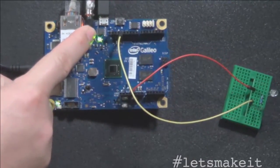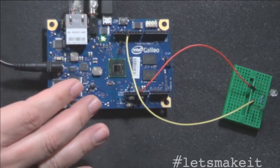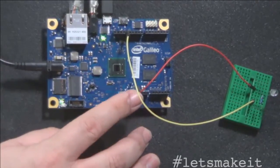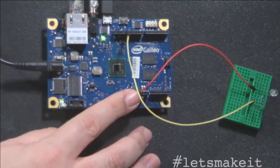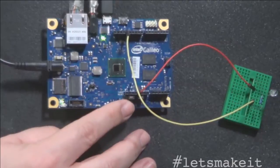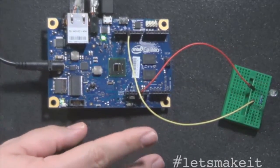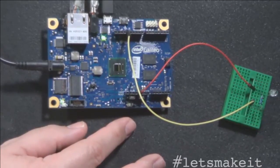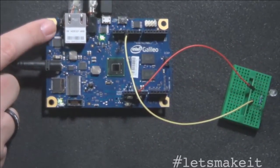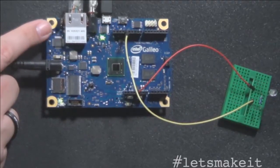This is a serial port, although it looks like a headphone jack — but that's not what it is. So overall it has all the features you get in most Arduinos and more. It'll take shields obviously, same shield layout as a Uno. It can do either 3 or 5 volt — there's a jumper for that. It comes with 5 volt, and that's probably where I'd keep it because most shields that work with the Uno are 5 volt. There's also another jumper up here to change the I2C address, which I'll talk about.